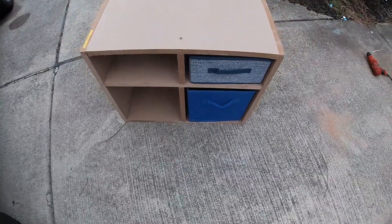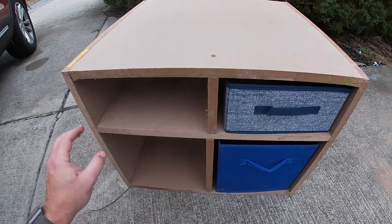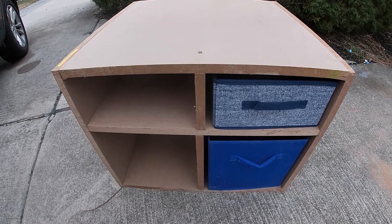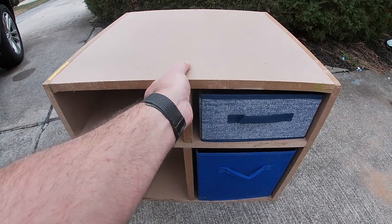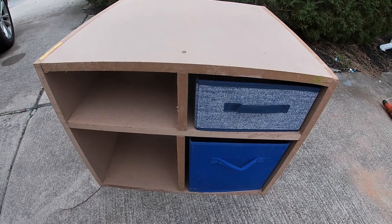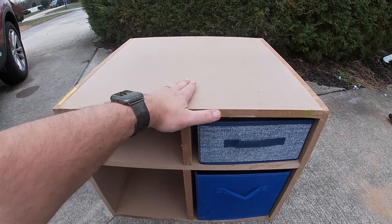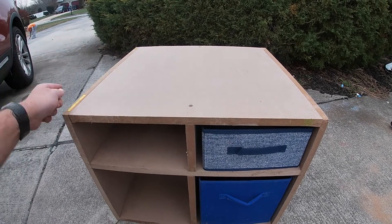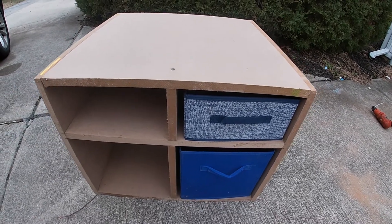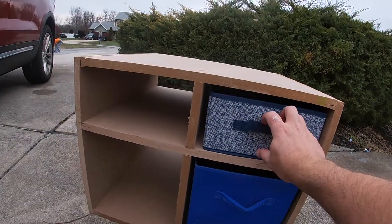Here is our base for the Lego table. The design turned out fine. My issue is that these screws really aren't working that well with the wood — I was hoping for it to lock down a little bit better, but as soon as you screw it in, it starts to strip out so it doesn't get super tight. What I'm going to do is get my air nailer and go all the way around all the joints to really sturdy it up. Right now it's pretty sturdy — it's moving a little because it's on the concrete — but it could be better.